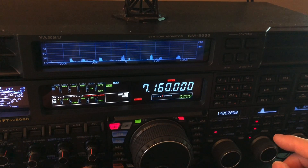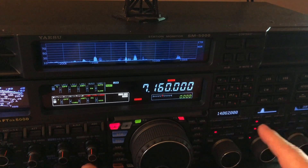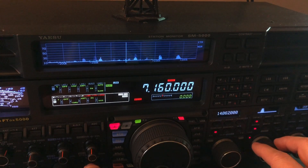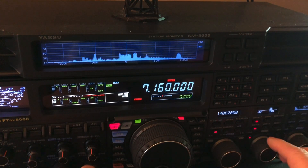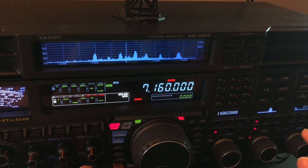There's one other option available for the FTDX 5000: an external version of this pre-selector. You pay extra for it and assemble it as a kit. There are three of them — one for the 160-meter band, one for 40, 60, and 80 meters, and one for 20 and 30 meters. The VRF is available for all bands in the radio, but the bands most likely to produce a lot of interference are 20 meters and below. These external models take it to another level — they're about twice as effective as the built-in one.